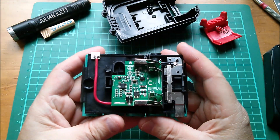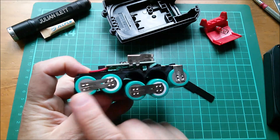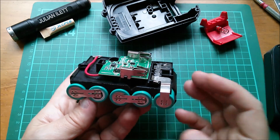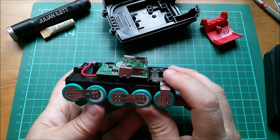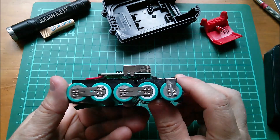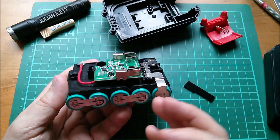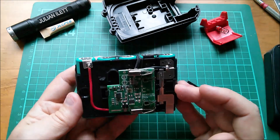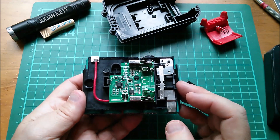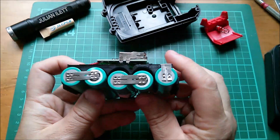That's really it - it's super primitive. But is it safe to charge a pack with no individual cell monitoring? If these cells got out of balance, you could potentially take cells well under the minimum 2.5 volts or well over 4.2 volts. Maybe they figured it wouldn't happen within the lifetime of this battery pack, since cell imbalance must develop in tiny amounts over numerous charge and discharge cycles.